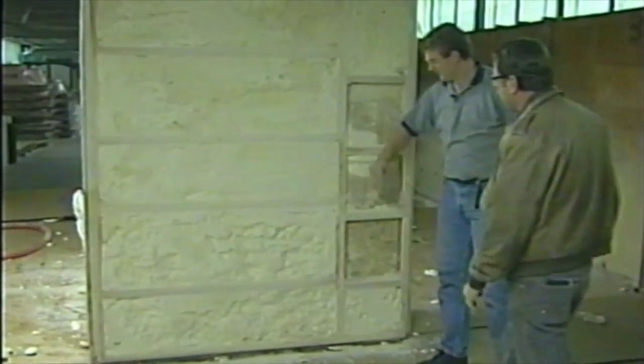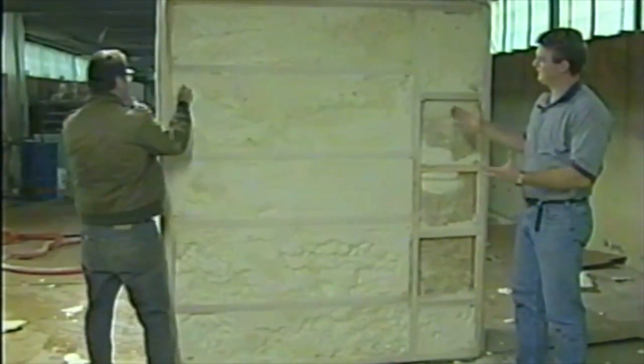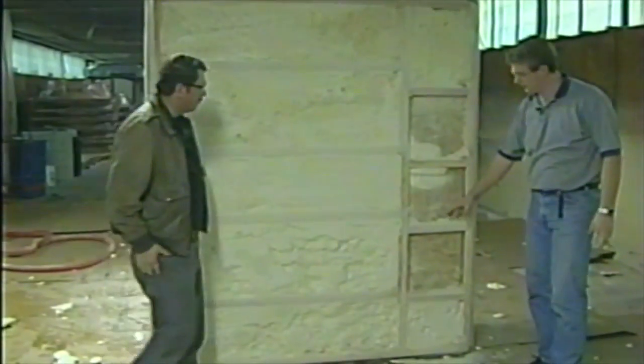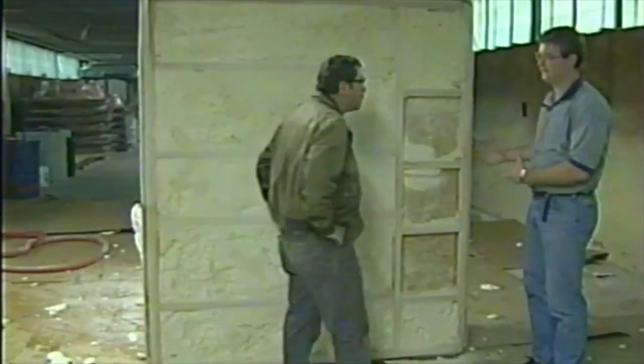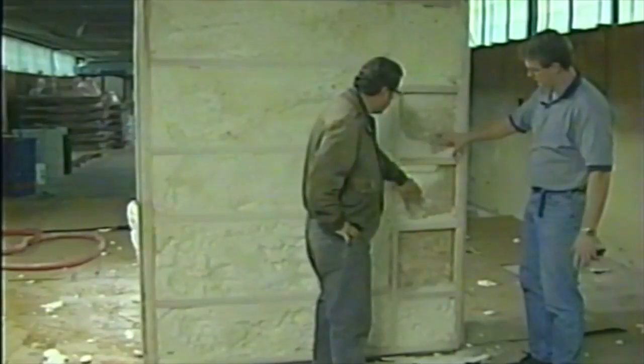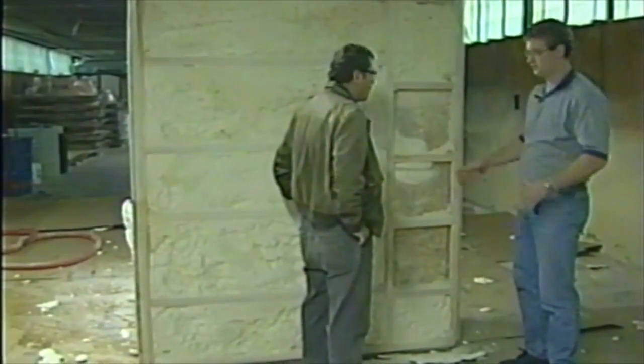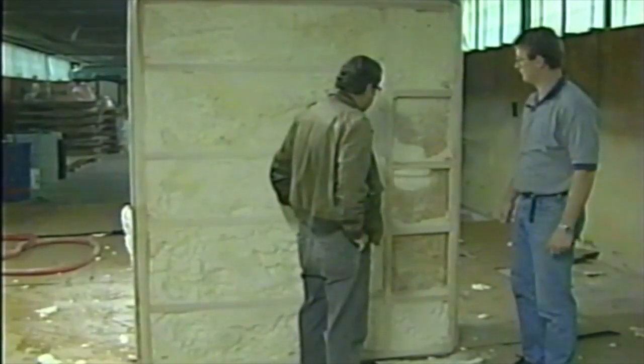All right, Stan, there she is. All finished. We've got her all the way packed up. You've got that nice hard polyurethane insulation, completely solid, foam filled. Now, we're leaving this area open here so we don't have an overheating problem with our pump area. This is where the pump and the motor, where your equipment's sitting down in here. Leave a little bit of air in there because your pump runs at such a high temperature. We're going to leave that open.